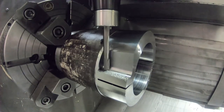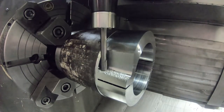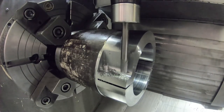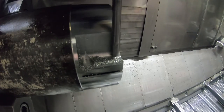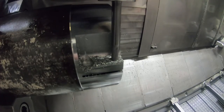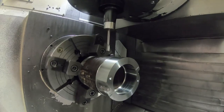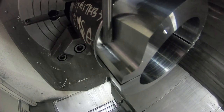It's putting the spot faces for these, which are also going to be quarter 20 screws that clamp this together. That's running a, that's kind of a long end mill now. I'm running it kind of slow here. This is sped up, of course, the video is quite a bit.